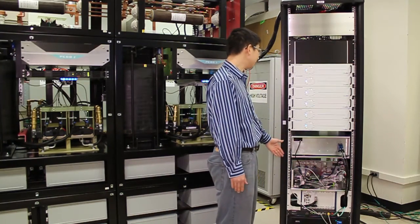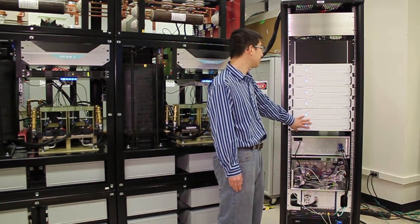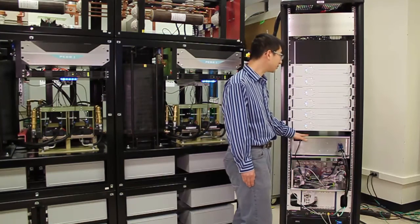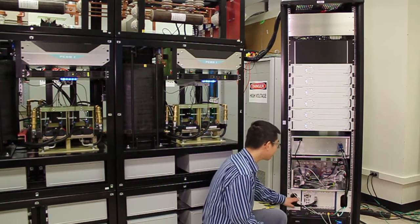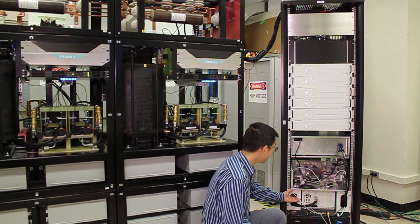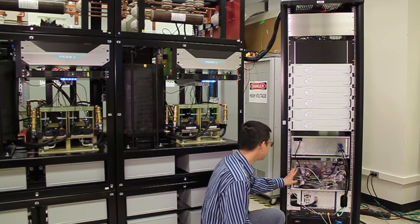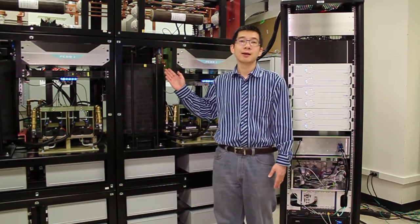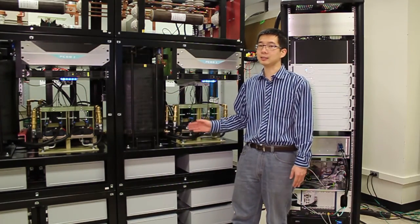This is the control unit of the IMU. On top of the drive, there are six current output drivers connected to current sensors. They are also connected together with voltage sensors to the signal conditioning unit, which does the analog filtering. The output of the filters is connected to the PXI computer that converts to digital signals. There is a real-time controller running in this computer to gather phase information. The bus in-between is the controller for the power stage. This control box also controls configuration and the sequencing of the output during power-up and power-off.